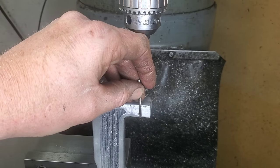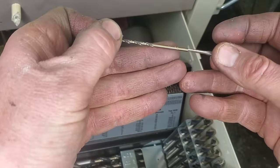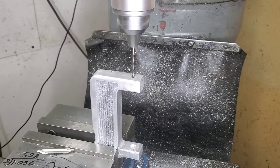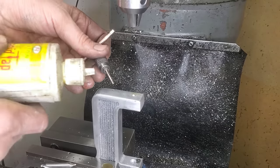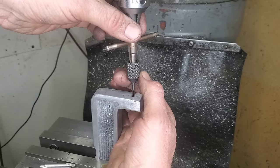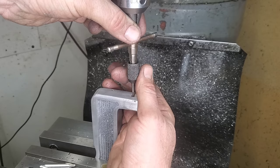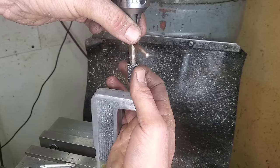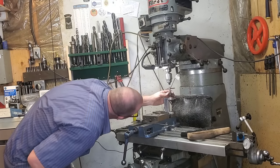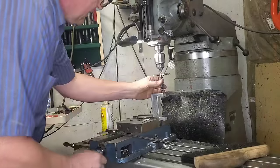One of the problems I actually had with this project is that tap wasn't going to be long enough to make it all the way through there. So seeing this problem coming, I'm going to go a bunch of sizes over and just make a guide hole for this tap so I don't have to worry too much about it going in straight. I'm only going to go down maybe an eighth of an inch, and the tap is just going to slide straight in there using the top of the drill chuck as a guide to keep it vertical. This worked out really well. I was a little bit nervous tapping something so small because I'm used to a lot of bigger stuff, and these little tiny things can break. Lo and behold, we're breaking through the bottom — and this is a whole lot of happiness.